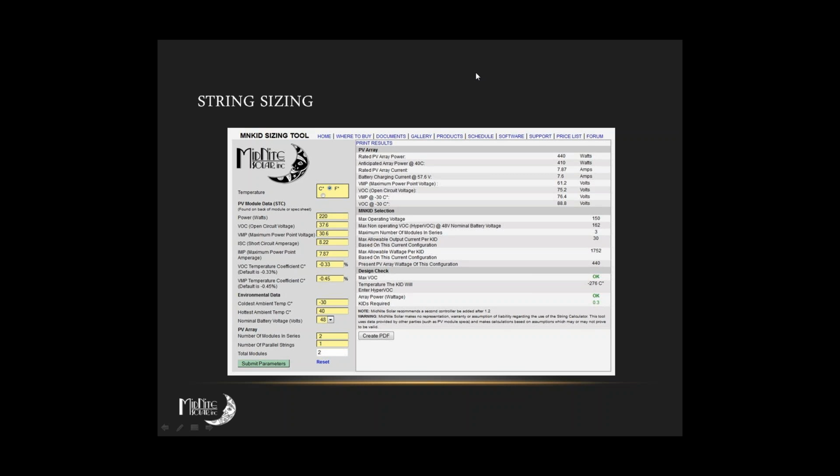Right, it's very common to use an 80% derating. I mean, you're going to lose about 20% off of any array. Dust and dirt factors, line losses, orientation losses. Most sites don't see 1,000 watts per square meter. You've got haze and fog and dust, et cetera. So 80% is a good derating factor. So your 1,000 watt array is going to average to be about an 800 watt.